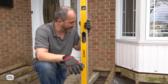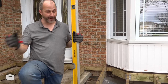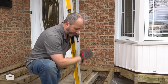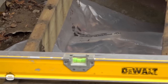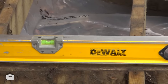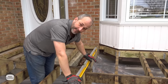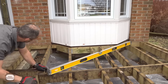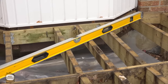In this situation, this DIY homeowner did a combination of both — and you'll see this all the time. People think it's a great idea to attach to the house and then just drop some 4x4 posts into the soil, pack it down a little bit. It's all a disaster. The middle is almost completely sunken, and there's a one-inch gap over four and a half feet. Going to the low part, I can stick my whole hand underneath. It's an eight-foot deck and the drop in the middle is dramatic. In that corner they didn't know how to keep it level — the last foot and a half is attached to a post that's buried, visible going down over a course of brick.